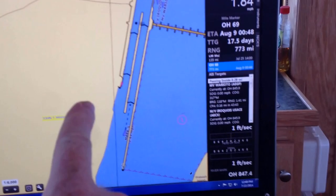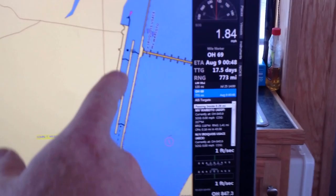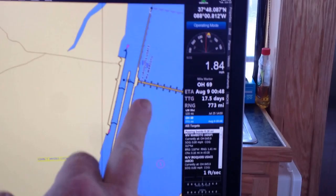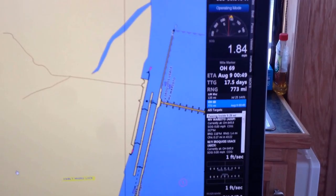We'll shove in. We come up in there. There's one shoving in ahead of us right now. Lower gates, upper gates. That's a short, small chamber at 600 foot. This is a 1,200 foot chamber. We'll shove in there, and they'll open the valves, which lets water in from the upper pool and raises up to that level, and then open the gates and shove out.